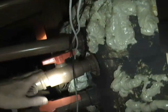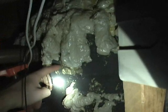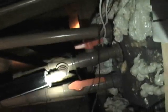The reason the pipe that feeds the house plumbing is the tallest is so there will always be water going inside the solar hot water heater. Even if my pump fails and doesn't fill my tank and I use all of the water, I can only use the water down to that level. That way, my solar hot water heater can't overheat because it's run out of water.